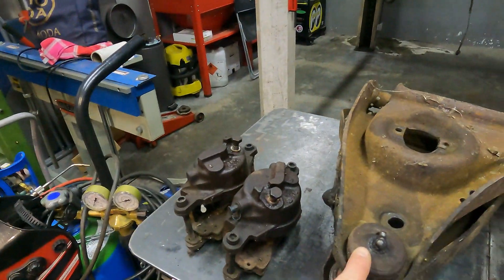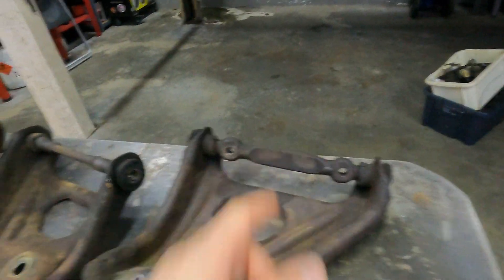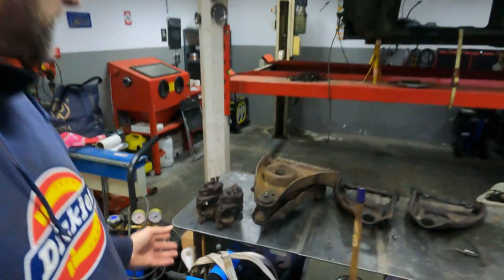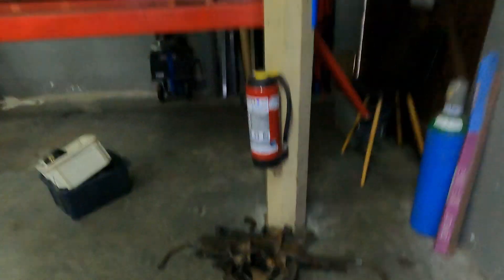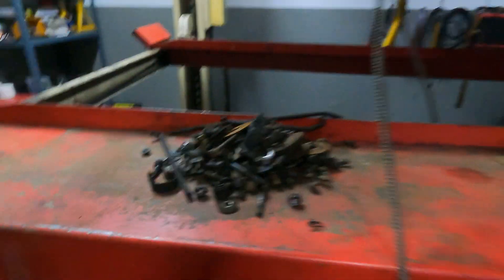Next day — I've just been pottering around taking all the bits and pieces apart: small pieces, suspension parts, ball joints and stuff like that, just stripping these down. The hydraulic press here is broken so I can't push those out, so there's probably a guy down the road with his own workshop we can use his press. Just need to disassemble the brake calipers, drums are coming off, all the bits and pieces, and we're making a pile of pieces that are going to go to the powder coaters — same as the front subframe, rear axle, all those bits. And all the nuts and bolts, we're going to have them all plated. I just thought we would use all the original nuts and bolts to keep everything original.